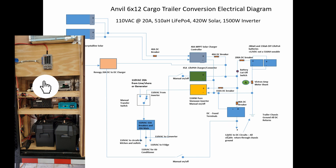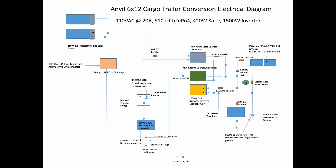All the DC circuits are returned through chassis ground, as represented here. Everything from a DC perspective is monitored through the shunt — all the ins and all the outs. Whether it's charging or discharging, it monitors everything so I know my state of charge at all times.